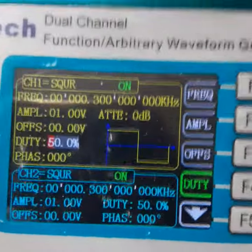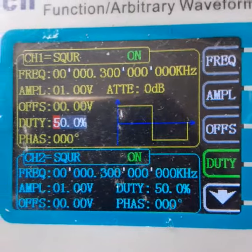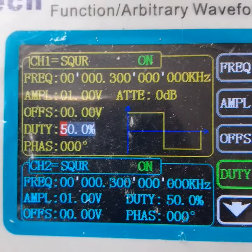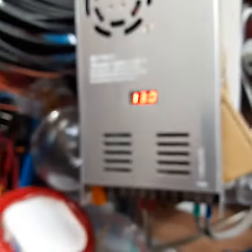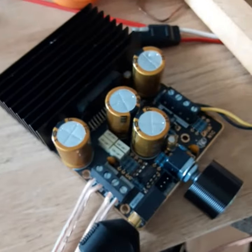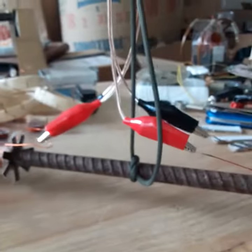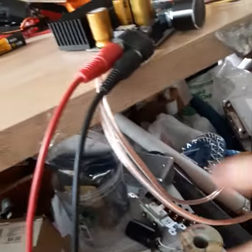Here's the setup. I've got 300 hertz. I can change the duty cycle on one channel from 60 to 40, back and forth. I've got the power supply set to 13 volts. I have an amplifier from Amazon sitting over here, and then I have it hooked to two coils, and it is dangling from a string connected to the ceiling. The cords go over and then back down to the amplifier.